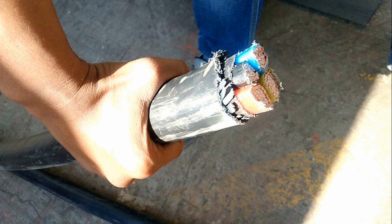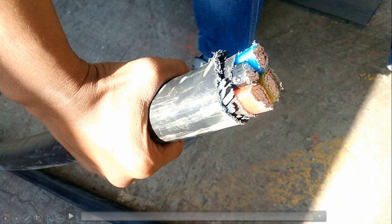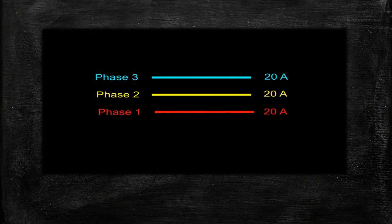One question still remains: what is a 3.5-core cable and what is a 3-core cable? Why is this little core used with these three core cables? Let's say you have a three-phase system where all phases carry equal amounts of current — 20 ampere, 20 ampere, and 20 ampere. This system is perfectly balanced and you have no out-of-phase current. In this case, a three-core cable is sufficient. For example, an induction motor — you only provide a three-phase supply to it with no extra cable.